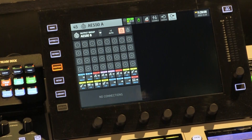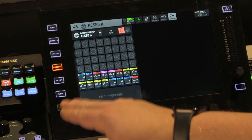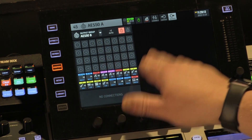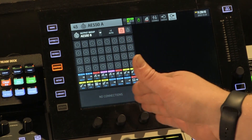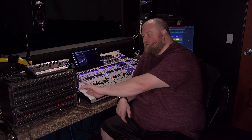In this case — this is the band — I'm only going to give them access to the first four vocalists, because that's all they need to hear. But then I'm going to give them every single instrument that I have, including the tracks and the clicking guide, and that's what that band would need. This is a really cool setup to really maximize those 16 channels on the P16 into two different groups of people using two stage snakes connected independently.